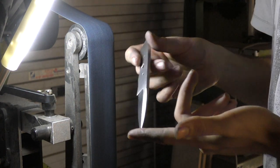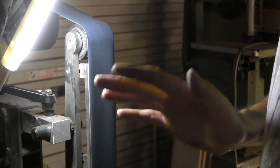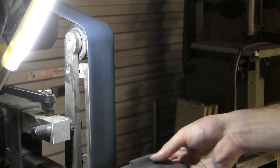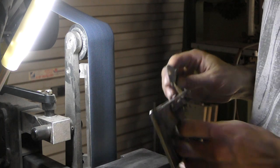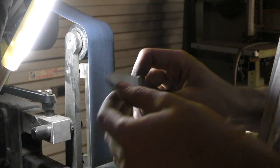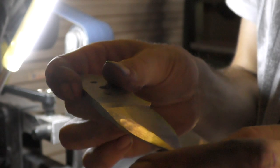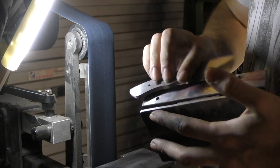That is essentially how to use the bevel grinding jig — it worked out really well. I'm actually very happy with the finished product. The main things to keep in mind when doing bevel grinding, especially with the jig: make sure that the platen is square to your base — that's very important apparently. Make sure that you don't drop your bevel grinding jig whilst using it because that's obviously going to affect it. After that little incident, the bevel grinding jig ended up on the floor, so I just avoided using it after that. I'm really happy with the general finish, there are a few spots I need to touch up. It's actually turning out to be quite a nice little knife. This method using the hole works and it works quite well.